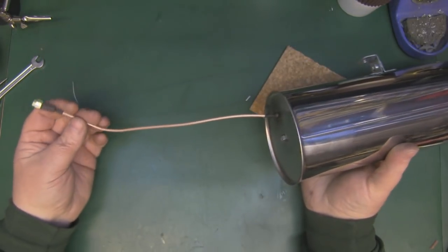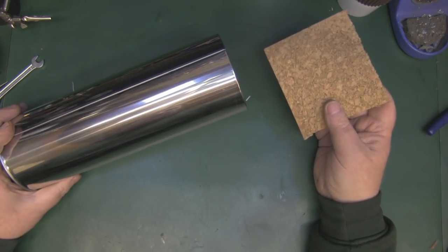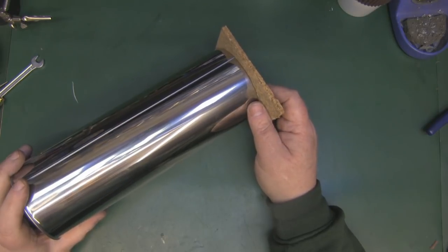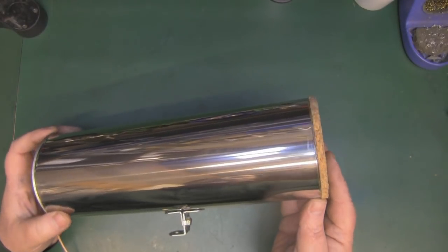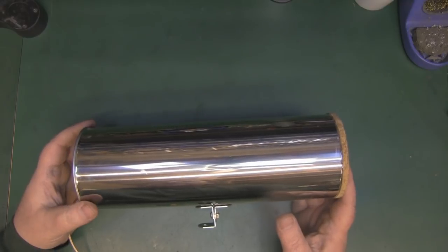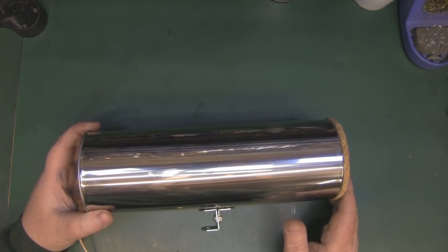I've tidied up the coax — just over 200 millimeters — and put an SMA connector on the end. For the end cap I'm using cork matting, epoxied onto the end of the can. Once set, I cut away the excess and shape it with a sanding block using the can as a guide to get it nicely round. Normally I paint cantenna builds black, but to differentiate this one I'm leaving the stainless steel exposed and just painting the end cap and back reflector black.